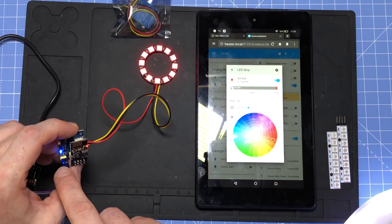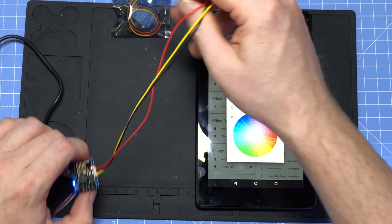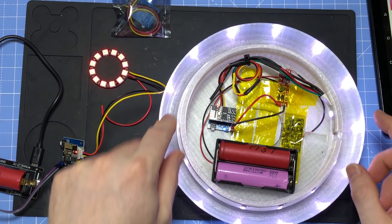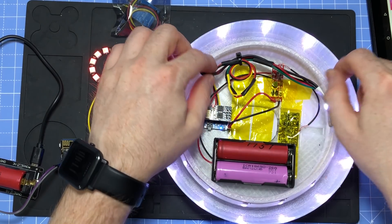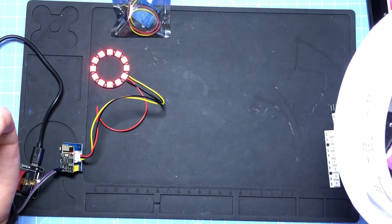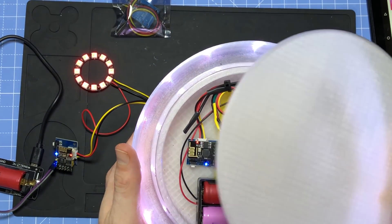The boards have their own built-in linear voltage regulator, the same as the last ones, which means you feed your 5 volts in and don't have to worry about stepping down the power for your ESP-01. For something small like this you can just power it directly off this module. With the LED cable strips they do give you a separate positive and ground to inject 5 volts — for this length of 15 LEDs I'm just powering it straight off the connector. If you had a meter-long strip you could still use this board because it's only doing control and signaling, not providing the power.